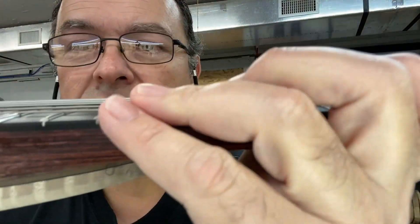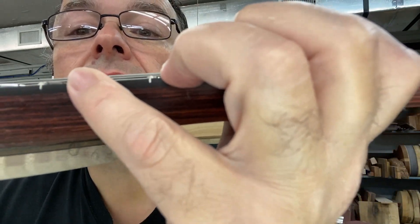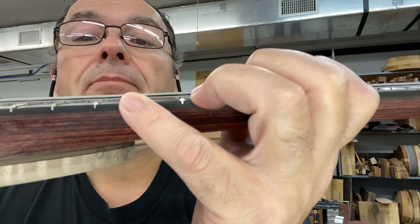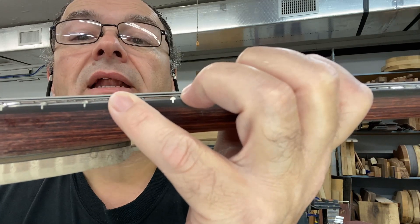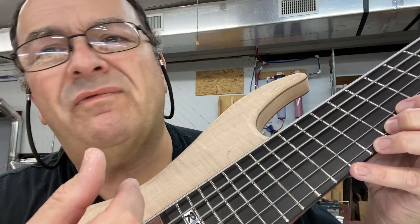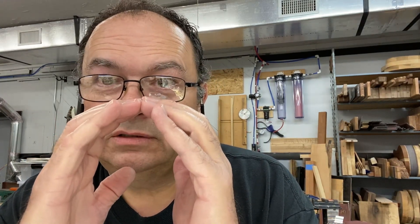If you can see the shape — of course it's not going to focus in. I'm going to get my fingers in there and focus on it. Maybe you can see that middle one in between my fingers. So you really won't be able to see it, but it's shaped like a pyramid. The reason why I like that is it's got a wide footprint — 105 wide, I believe, and it's 55 tall. But if you look at a normal fret, they're just a big hump, and when you level them, you end up with that big flat, and you still got these two big sides. You got a school bus, and isn't that worse than a school bus crowned fret?